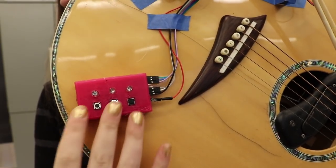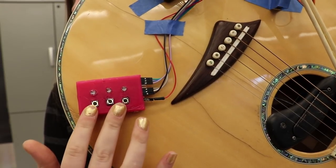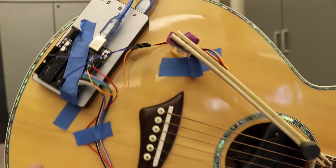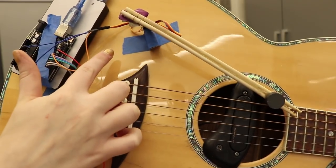I'm very proud of this hardware I built here. Three LEDs and three tactile buttons wired to some protoboard, and I printed a little 3D case for it. They control a bunch of inputs that all go to the Arduino, which controls how fast the servo goes.